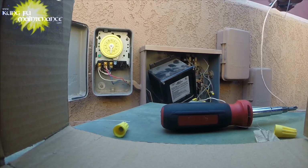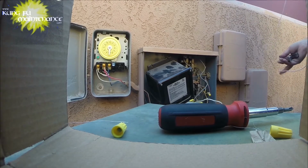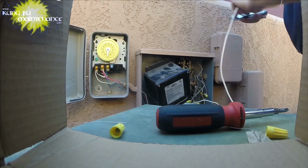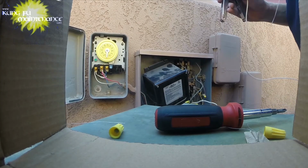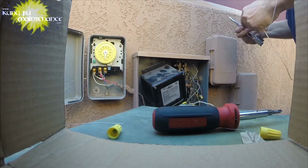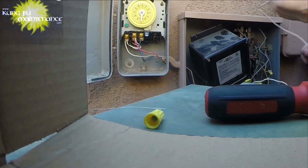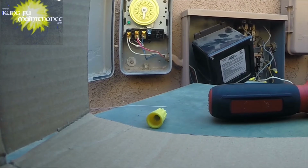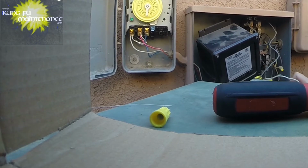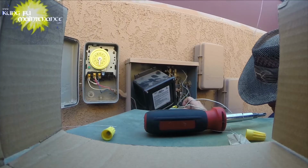In a lot of situations, you're running all the neutrals together and then running the neutral wire off to each outlet. But on a GFI, all of the load is controlled by the GFI, including the neutrals. So the neutrals have to be separated from the other neutrals. The line coming in is all on the neutrals to the bus bar, but then the neutral that travels on the load from the load side of the GFI is all separate. It's controlled by the GFI.